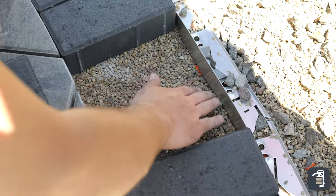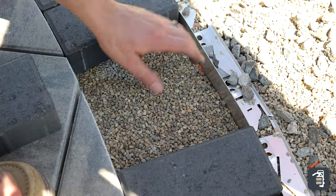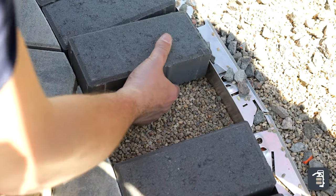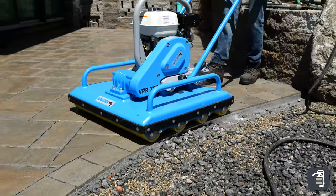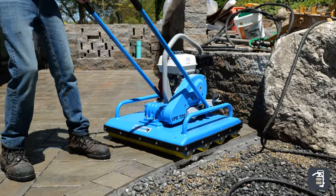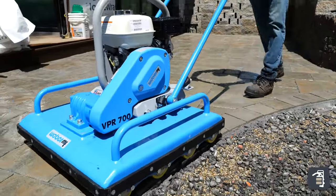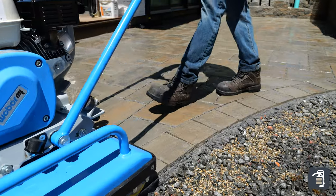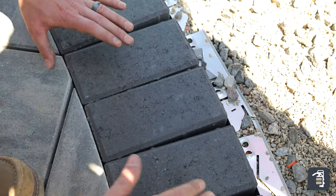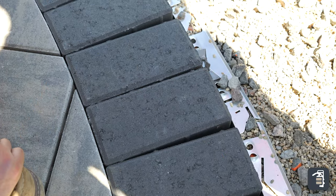You can see here we have a little bit of a divot where we drove that spike in on the outside edge. What's going to happen when you hit it with your VPR 450, VPR 700, your rolling compactors, or even a plate compactor — when you vibratory roll this top, go right up against that edge and make sure you hit the edge really well. It's kind of opposite of concrete; with concrete you don't want to hit the edge, but with our edging you're going to want to hit the edge real good. It's going to vibratory that number eight stone right into place and you won't have a problem.